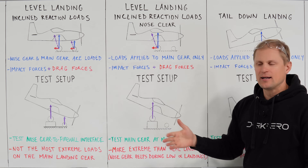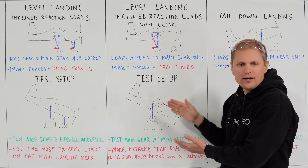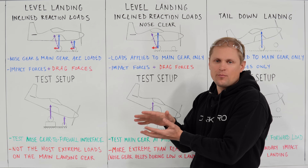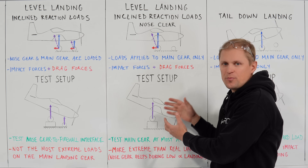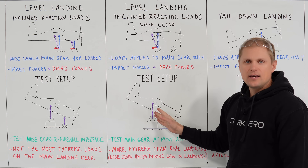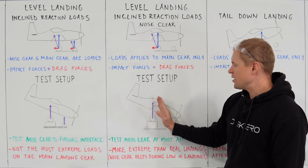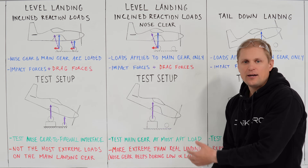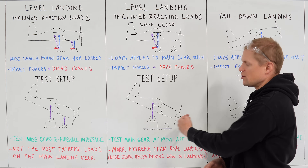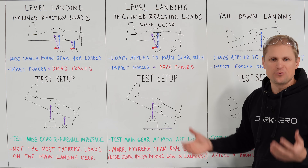This is actually a little bit more aggressive than real life because in a normal level landing at a lower angle of attack, the nose gear starts to help out at some point. The angle of attack on landing might be between zero and five or six degrees, and in that window the nose gear is going to help the main gear. But for test purposes we can go more aggressive to prove out the main gear. This is the aftmost pointing load vector on the main gear — this force vector is pointed aft a little bit towards the tail. If we land nose high or tail down, that will get this load vector to point forward.